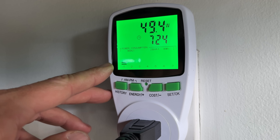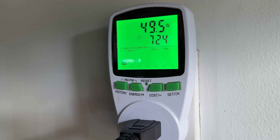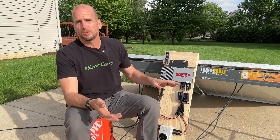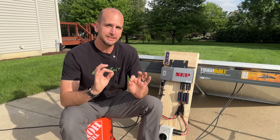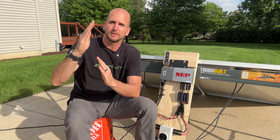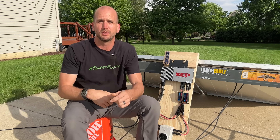What about cost and overall production? For the micro inverter, 50-foot extension cord, and power meter — the meter has bars in the lower left corner that give you kilowatt hours per day, adding up throughout the week. I recommend used solar panels at about $100 per panel. You'll need a mount (about $100 for a cheap one), and you'd want to run that into an exterior dedicated 20 amp outlet with an in-use cover so it can seal off while plugged in. All together you're probably looking at about $850 all in.